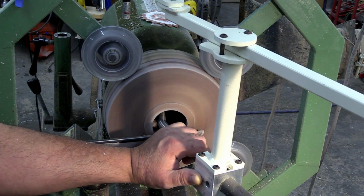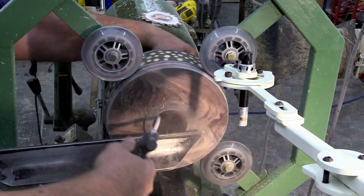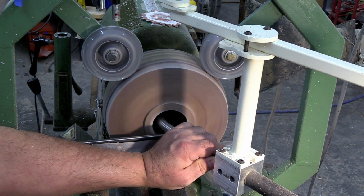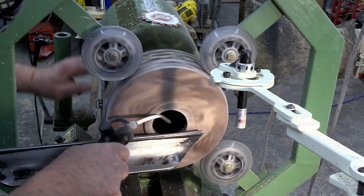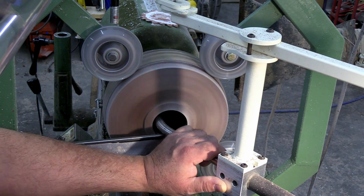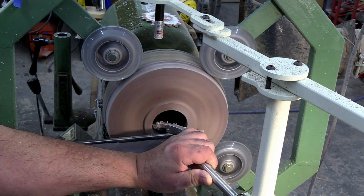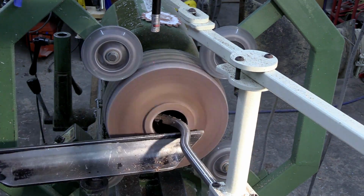I did actually use all 3 bars that come with the system here. I cut a ton of footage out of here, trust me. The wall thickness on this ends up around 1/4 of an inch, and the birch spacer that was inside, I think that it ate up a lot of resin. Birch is actually quite porous and soft, so that might explain where a lot of the resin went to, because you could see through it when you hold a strong light on the outside of the form. You could almost see through it. So that's where I think a lot of the resin went to. Anyway, still got some improvements to make. Eventually it'll be a fantastic thing and won't give me any issues at all. Hopefully.